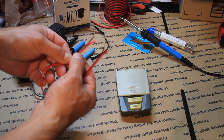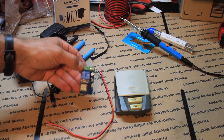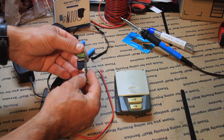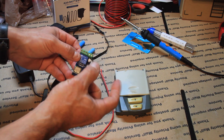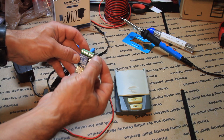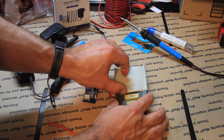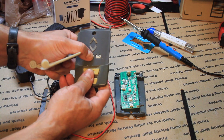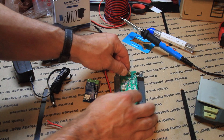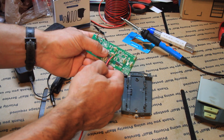First I gathered some materials. This is just a length of two wires stuck together — red and blue, though the colors don't necessarily matter. I also got this little controller — it's a Wi-Fi smart inching relay. What that means is that when you initiate the command, it's going to connect the relay for a short amount of time, probably half a second or a second, and then open it back up, simulating pushing a button. The button on the remote that activates opening and closing the door is this middle button here, and it's the same button for both open and close.